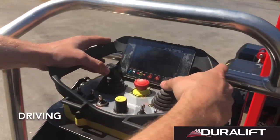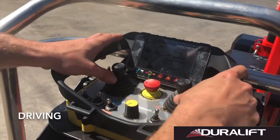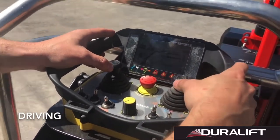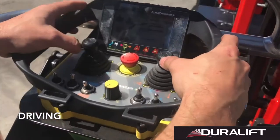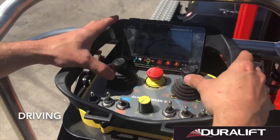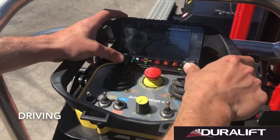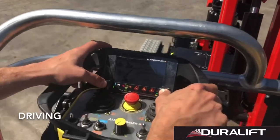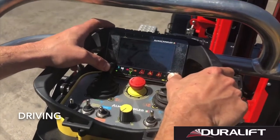This now eliminates our slew restriction and our telescopic boom restriction. When we start to drive, the machine's automatically going to lift into transport mode of 15 degrees of the upper boom. So now we're ready to drive. We'll hold forward. You'll see our boom lifts to clear our jib from the ground, and we're now ready to start driving.